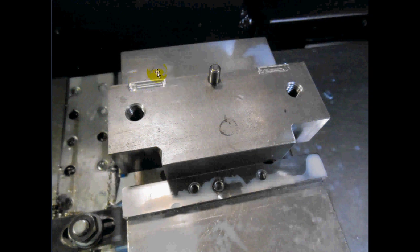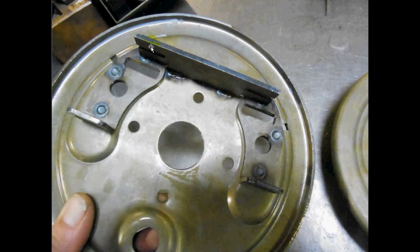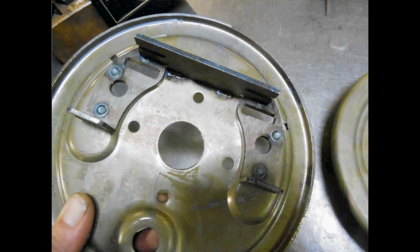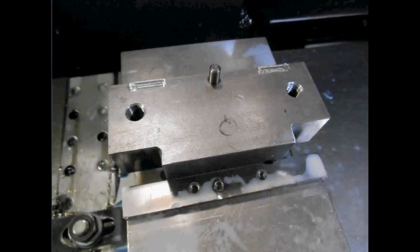What I did was kind of time this out so the weldment on the other side, this part, hangs off the back edge and is cleared by 1/16 of an inch. I didn't want it to hit the welds or anything else. So that's how I cheated my way out of this. I made this simple cold roll fixture, and all I did was make sure this back edge cleared this piece of steel that had been welded on. And then what you're going to learn today, though, that's, I realize, not rocket science.